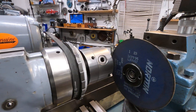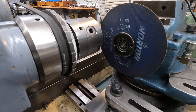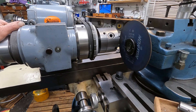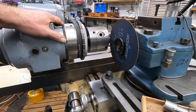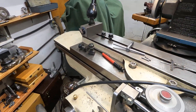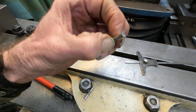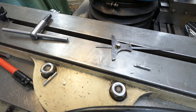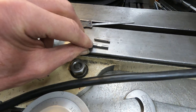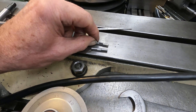I've got a reinforced cut-off wheel here mounted in the wheel head, and I've got the motorized workhead here with the three-jaw chuck. Let's get over here and I'll show you what I have to do. These are the cutters here — it's a D-type cutter, and really quite easy to grind. But I've got to make the blanks first, and this flat locates it in its tool holder, so I've got to do the flat.